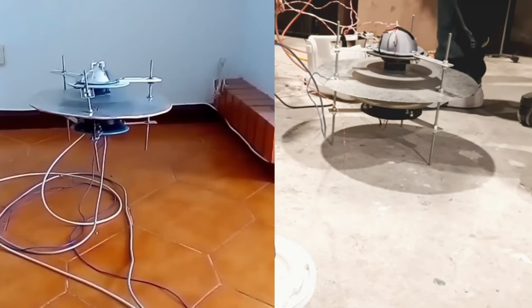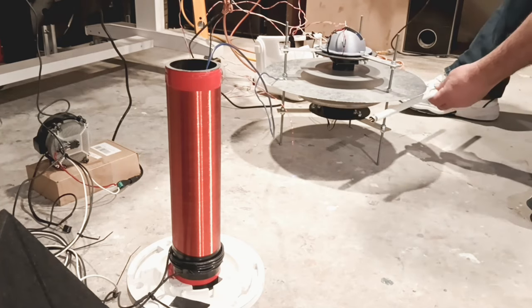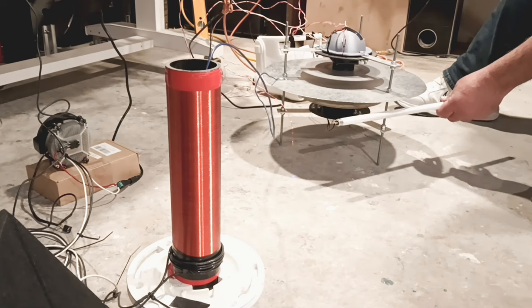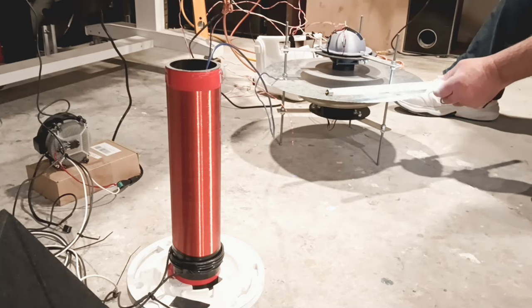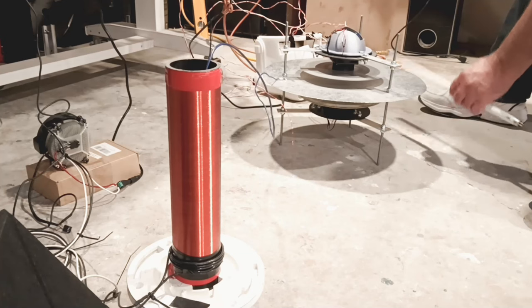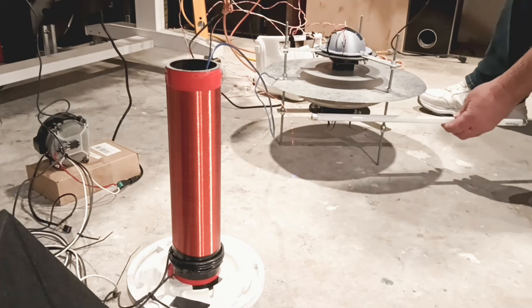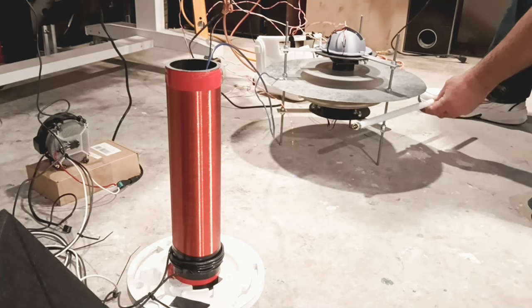Let's get into detail on this. First, our Tesla coil is on, we're at 33.3 volts, and we have our motors running. I like to run the bottom one - it's a 12-volt motor, so 11.5 volts are going into it. The upper one we're going to change a little bit to manipulate the field. What you have to know is that your motors are tied into your high voltage - there are two high-voltage flybacks in series on this, connected at the center, with the Tesla coil connected to the outside or the frame.